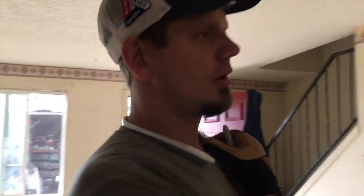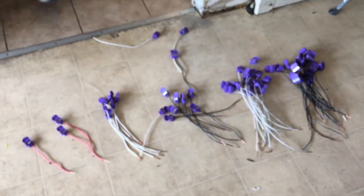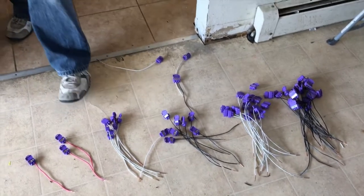Bottom line guys, we're doing this whole apartment — it's a two-bedroom apartment, laundry, kitchen, whatnot. We're doing all the pig-tail copper splicing, probably about 50 devices. Here's all our two-port and three-port connectors. There are some cities that are requiring, if you change out your plugs and switches and GFCIs, that you put in arc faults.